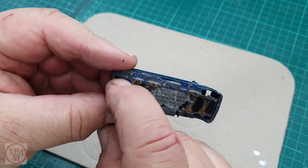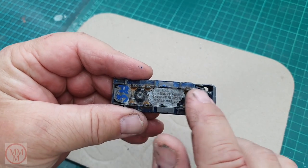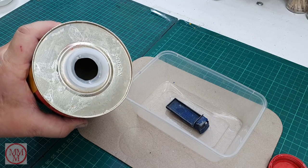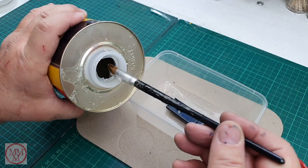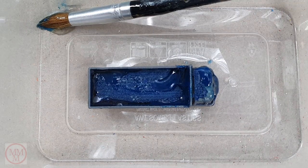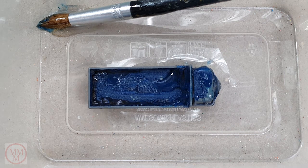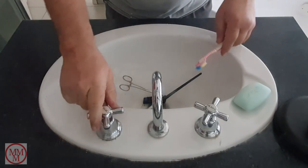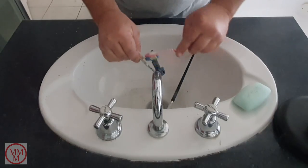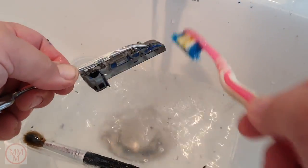Looking at the base here, I've decided I'm not going to remove it. Instead I'm going to repaint it by hand after I've painted the model blue. That way I don't have to drill out the rivet. The reason being is the bed of the truck is very shallow and I don't think there would be enough rivet left to thread to put in a button-headed screw, as is the norm. I'm running out of paint stripper so I'm being a little bit frugal with it these days — instead of tipping it all over the model I'm painting the paint stripper from the can onto the model. Because of COVID-19 restrictions we can't go out to hardware shops anymore, and to order online takes months, literally. So I have to use what I've got and try to make it last.